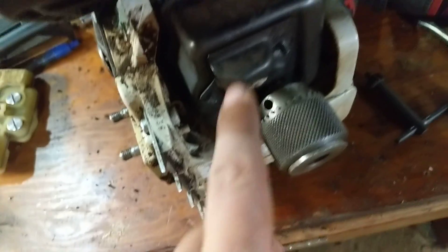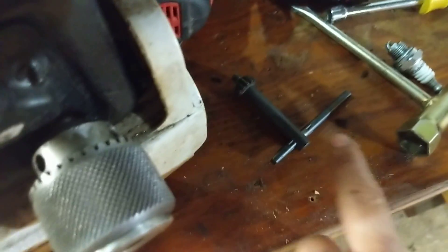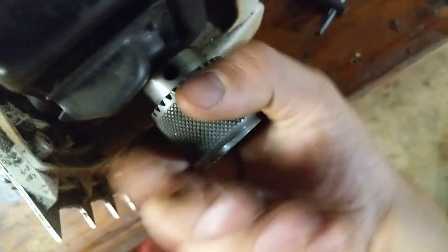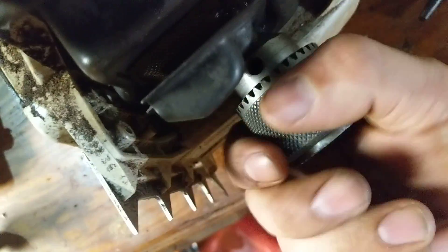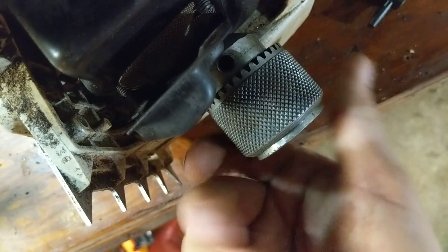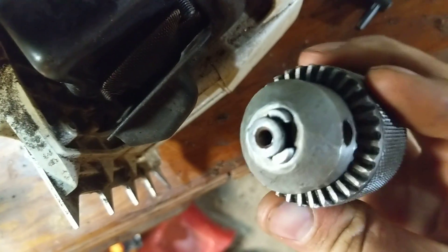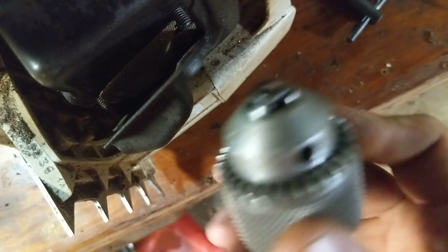Here is my solution. Whenever I can't get a good grip on a nut or a bolt that is in a good spot, I use an old drill chuck — of which I keep several on hand — and a long-handled key to tighten it on there, and then I can just loosen it. This old number two A Jacob's chuck has some really aggressive knurls, so you can actually use it kind of like a screwdriver very easily. It does get a very good bite, and even though I didn't get a perfect seat on that nut, it came off without any problem.